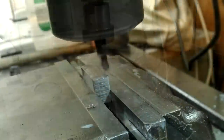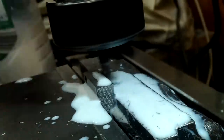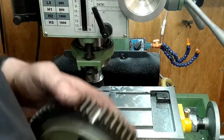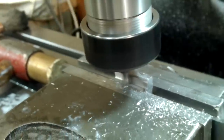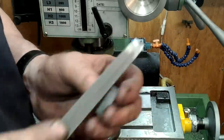To make the dovetail I used the same single point cutter. I touched on the top of the material to gauge my depth, then formed the first side of the dovetail. While at the same depth I made a couple of false cuts so that I could check the fit in the gear. After a few trips back and forth to the mill I found the size I needed. Because I only made short false cuts each time, as soon as the dovetail did fit it wouldn't be tight enough. So as soon as it did slide together I made a note of the size and backed off by 0.05mm — approximately 2 thou. I machined along this side but before the cutter completed that side I added the 0.05mm back on. The end result was that the tooth could be started in either end but would be tight in the centre of the casting.